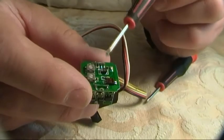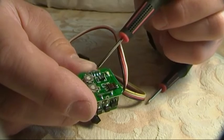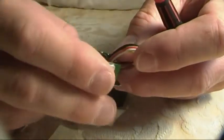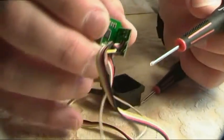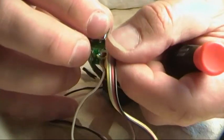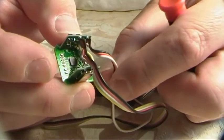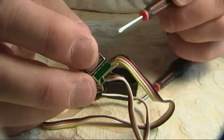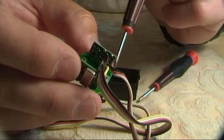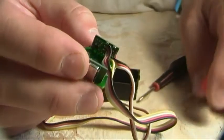What I'm also going to do is put hot glue over these solder joints and these solder joints on the other side. If you turn the gyro over, you can see the wiring in here. The solder appears to be OK, but the wires are very flexible. As the helicopter vibrates and moves around, that could potentially come loose. So I'm going to put a whole lot of hot glue around that, just to give the wires some added rigidity and strength.